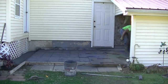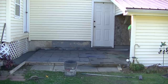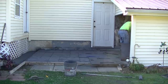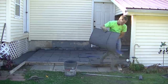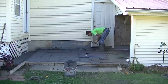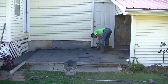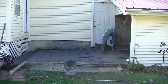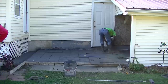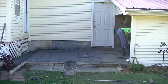So this is how you pour a stamped concrete patio over an existing old concrete. You can do it — there's no reason to break out that old concrete if it's structurally sound. Now if it's settled and heaving and all cracked, then yes, I'd definitely recommend taking out the old one. But if it's still in good shape, it's not settling, the frost hasn't heaved it bad, then there's no reason to take it out. You can pour right over it if you have the room to pour over it, which they did here. If it was butted right up against that door sill, then I wouldn't have been able to pour over it, I would have had to take it out. But this one, as you can see, we had plenty of height — it actually made the height a lot better.